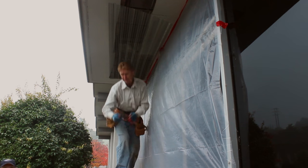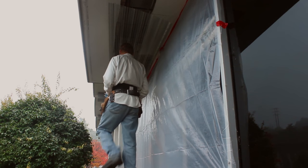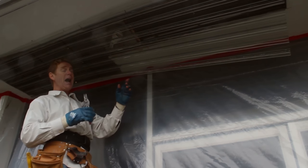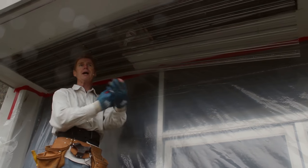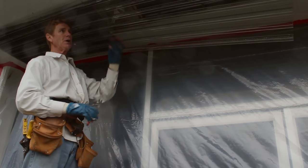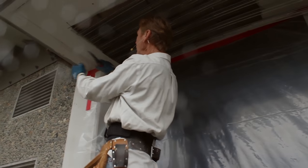Now, your snips — how many of you understand what these are for? The yellow ones are straight and they'll work. The red ones are slanted — why the slant? And why am I wearing gloves? Because what I'm about to do — if I'm not wearing gloves, my hands will bleed in about 30 different spots. It's like dragging your hands on a cactus. Wear gloves when you're cutting any kind of soffit mesh because it's razor sharp.